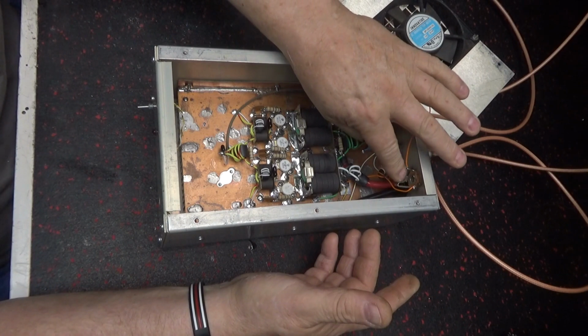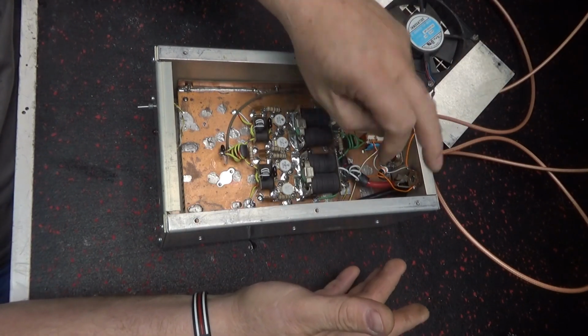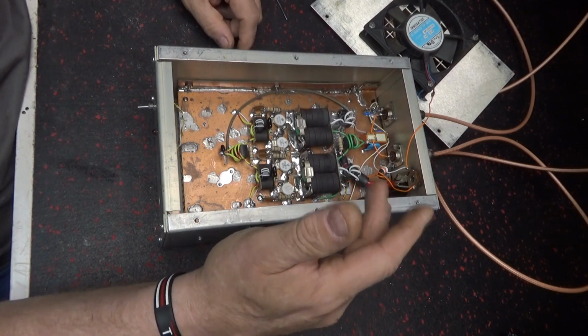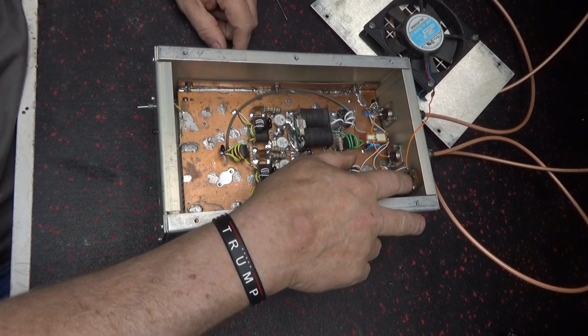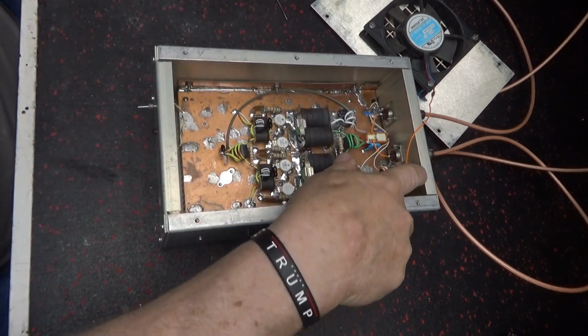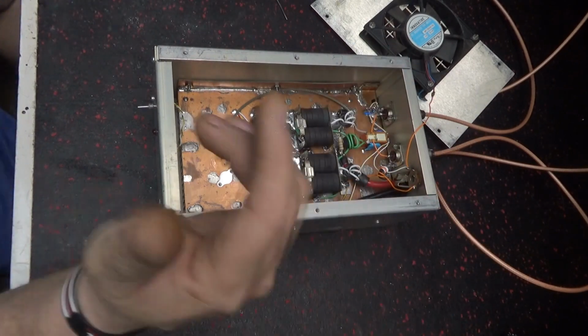Now, by the way, when you hook that up, make sure the power is unhooked from it when you unhook it, because they will arc together in there and it'll be a hell of a mess. So anytime you have any of these jacks like this, don't hook them up with power on it. Unhook the power, hook this in, and then hook it back up. And then again, it could be wrong even then.